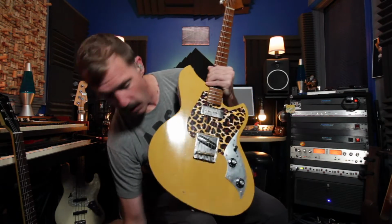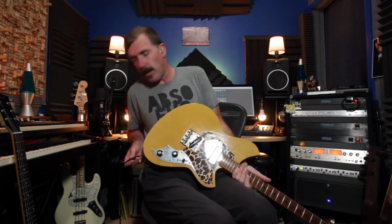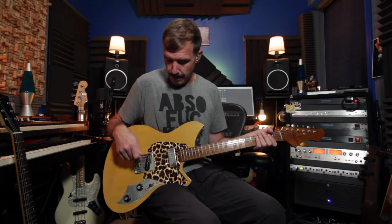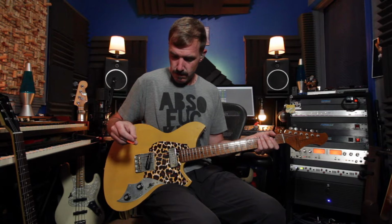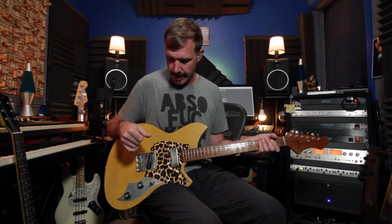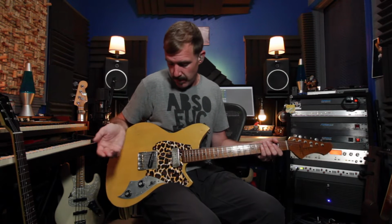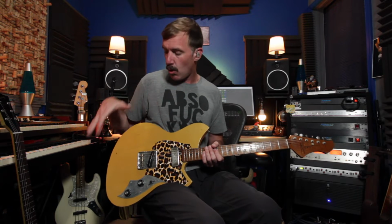And we'll plug in my Novo real quick with the neck pickup. I don't have a P90 bridge pickup in this, but so you can hear there's a little bit of noise there, but this to me sounds like it's a little bit quieter. The other one was at -40. This one's at -50. So this noiseless is about 10 dB quieter than the Mojotone that I put in.